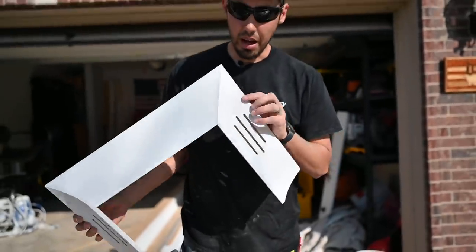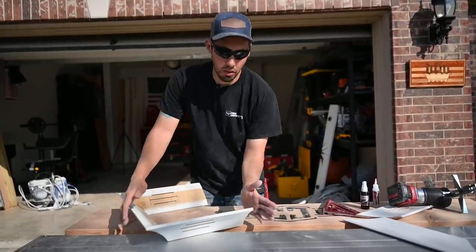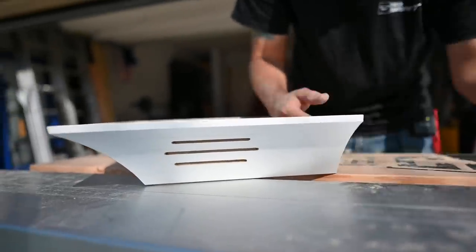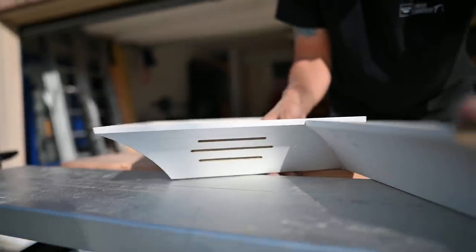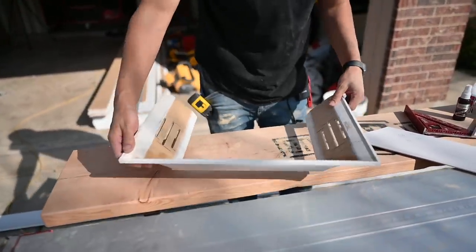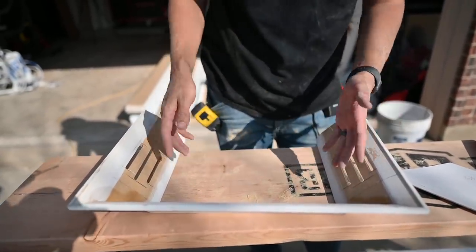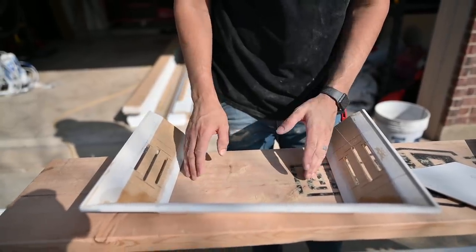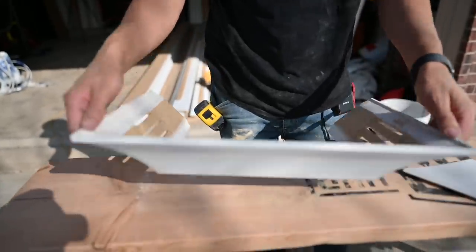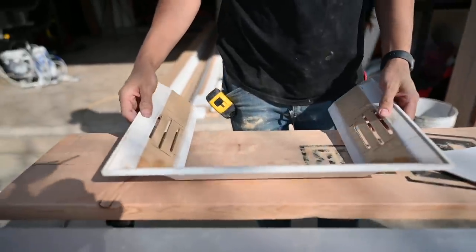We have our crown wrap-around with the vent slots cut — I think they look pretty stylish. When that air comes up it's not going to be able to twist and turn that corner because it'll be coped into itself. The only place that air can go is in a circle until it eventually gets out of one of these vents. It could push to the front but it'll just turn the corner and come out the other side. I think the way those holes are drilled it's just going to shove it straight out.